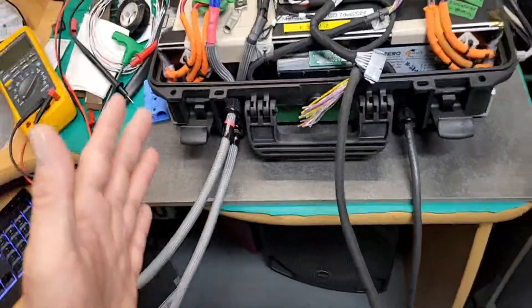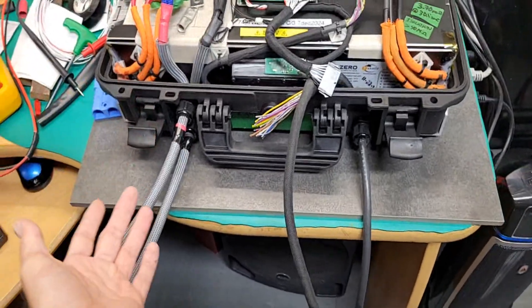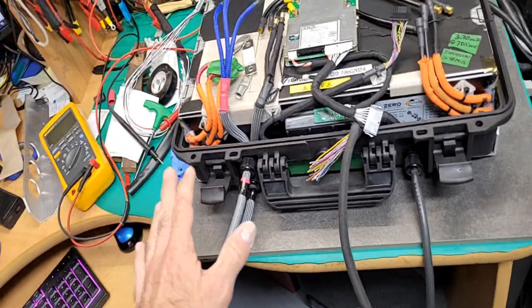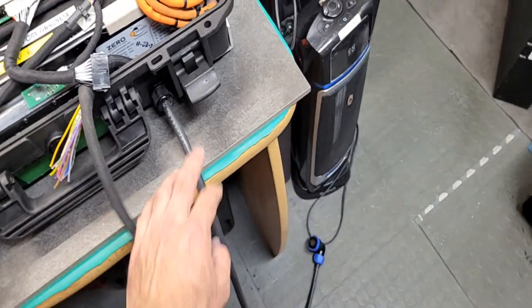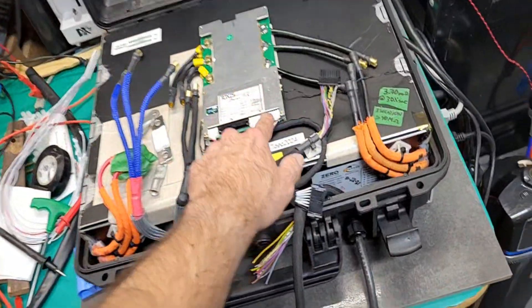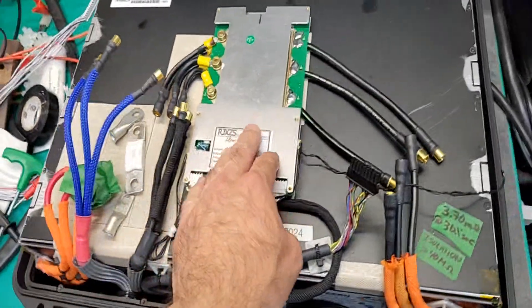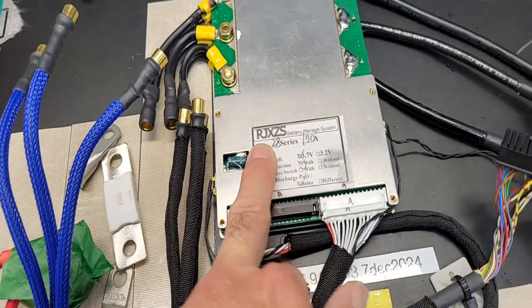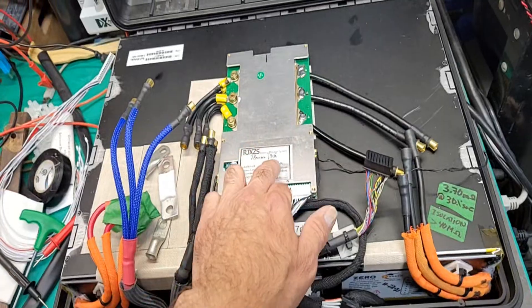I'll need to carefully manage the connections — it's important to have the negative of the battery and the series link connected in the right sequence relative to the BMS connections. By the way, I also have temperature sensing on both sides — four channels to monitor temperature on this BMS. It's a Jibaida BMS that I like a lot, likely rebranded under this other brand — hard to find but it exists — rated at 100 amps continuous.